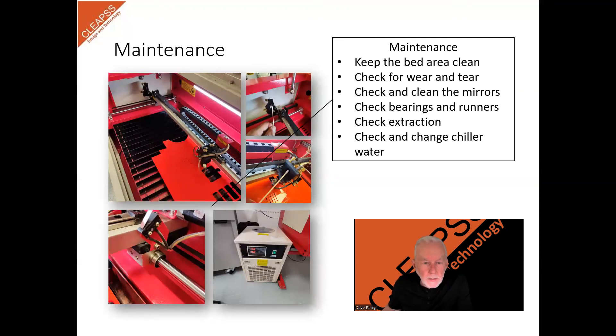There are a couple of things that you need to do between the uses of a laser cutter to ensure that it is left safe for use for the next occasion. Firstly, you should remove any debris from the laser bed after each use, but it is always worth checking before use that the last operator did clear up after themselves. You should also check the bed for wear and dirt residue before use, and where necessary clean the bed. This can be done with hot soapy water, but there can be some very stubborn oils and glues that are left after cutting, so it may need some soaking.